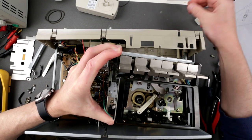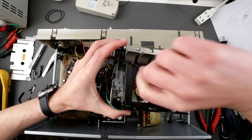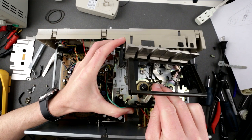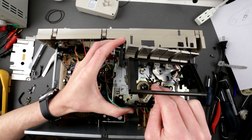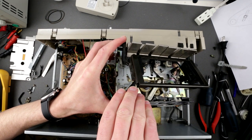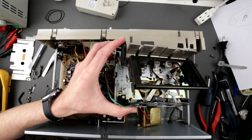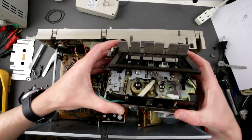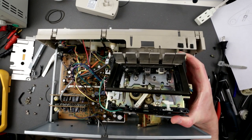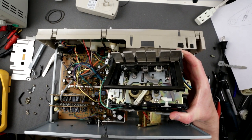Okay, we have to put the capstan washer back on. That's a very important part, so the capstan washer should be installed for sure, not all the way back. It has to have a tiny gap in between the bearing and the washer. Now I have to clean up all this, because as you see, it's super dirty, so I'm not going to be shooting video of how I clean it up, and maybe during the cleanup I will recall where the last screw is supposed to go.